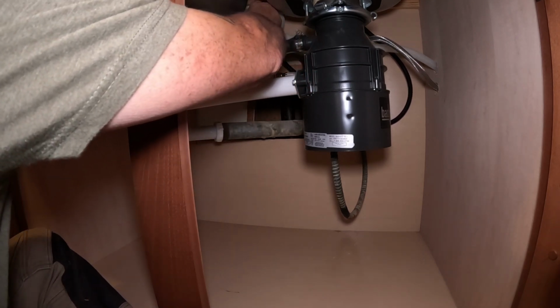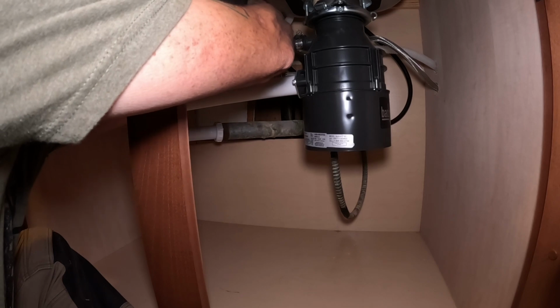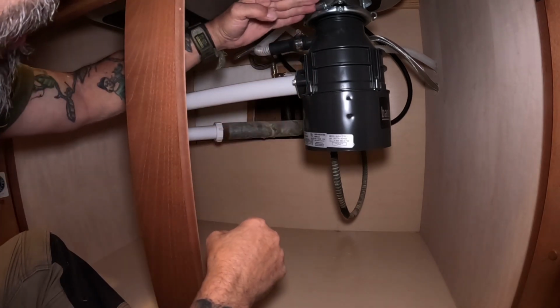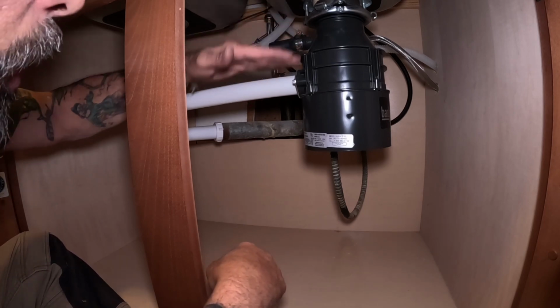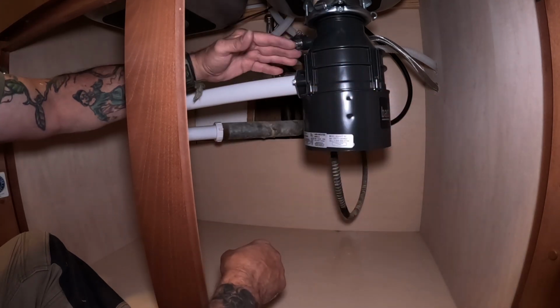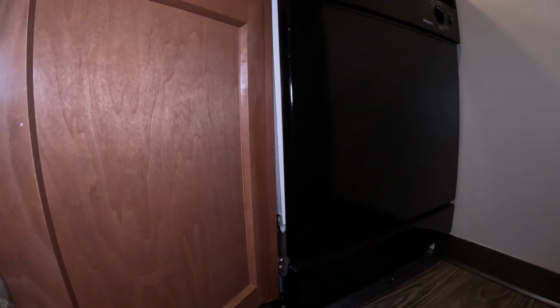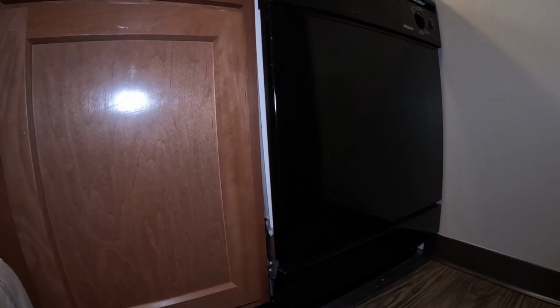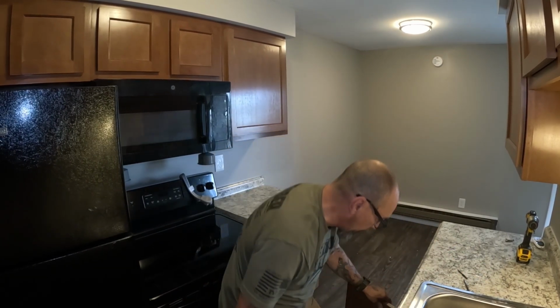It prevents the water from the dishwasher from flowing backwards. You know what I'm saying? So water builds up to here, right? So if the trap is lower, or the line is lower than this, what'll happen is it'll shoot the water down inside the dishwasher. So you'll get water coming out of your dishwasher, overflowing, getting water on the floor. You'll have water coming out of the rim. You have a water leak. And that's exactly what you call. Or you'll get a call saying that the dishwasher's not working, when it is working, it just can't drain out all the water.